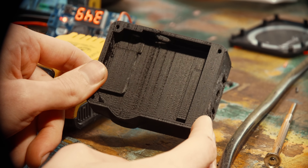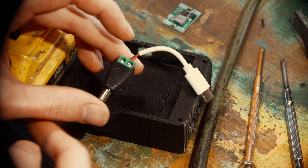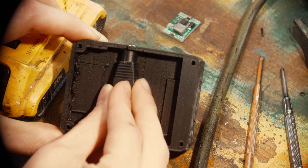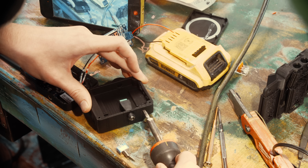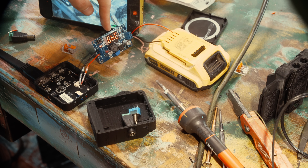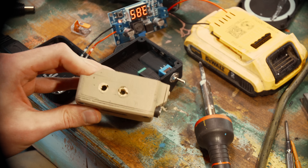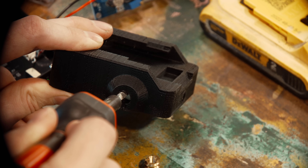Let's get this cleaned up and all our components in there. Also worth noting — without disassembling the wireless unit at all, I could have just made a basic USB-C cable to a DC power output that would plug in and do 5 volts. But I like the idea of cutting out the battery entirely, and I wanted to remove the magnets anyway. So this unit will have a little DC power plug coming off of it, and on the power tool battery side we'll have a female port for that to plug into. I've got a hole for a power switch which apparently I didn't make big enough, so I'll just melt that switch hole a little bit wider.